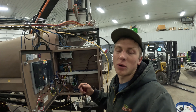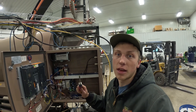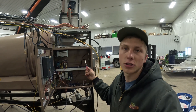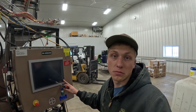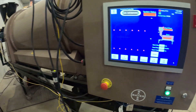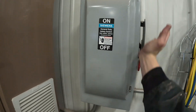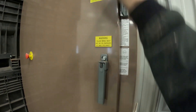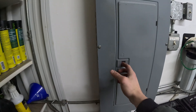I got all the cables inside the computer screen put where they needed to go. Thankfully the first time we took it apart we labeled each wire and each connection it needed to go to, that way every year rather than having to search back on my phone for a screenshot, you just look right up there. Now we'll try to plug it in and hopefully everything works. I got both conveyors plugged in and it's still showing on the display that it's not finding any of the information. I'll verify the fuse box - kick this on, then kick on the main control panel and see if it's going to recognize anything on the display. It's still not recognizing any of the seed treating equipment, so I'm going to go into our supply room and check the fuse box to make sure the breaker's on to run the treater.